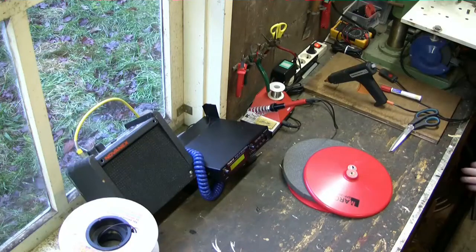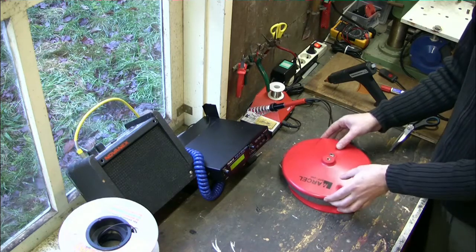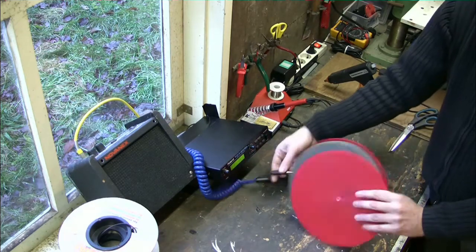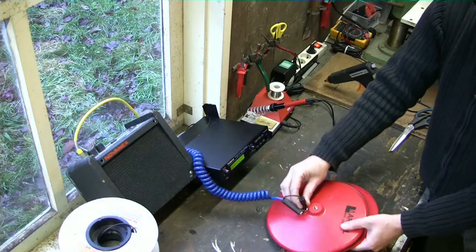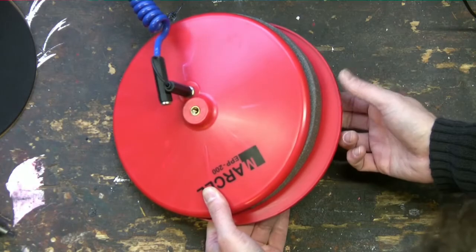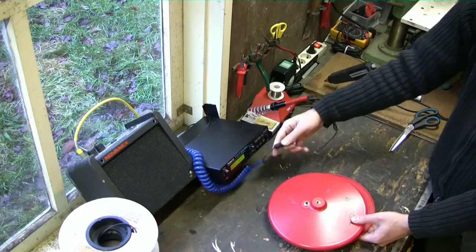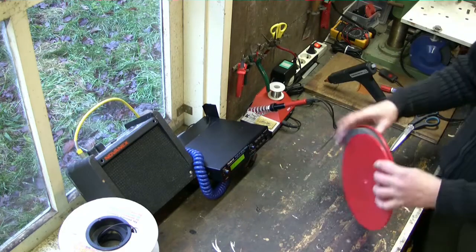Before you glue all the parts together, I suggest you test it first. Even if you tested the trigger after you made it, because it would be a shame if you found out it didn't work after the drum pad was glued together. So here I have an old Roland TD7 module that I use just for testing. Just plug it in and tap the top plate with your finger. If you do not hear a sound, there is something wrong.